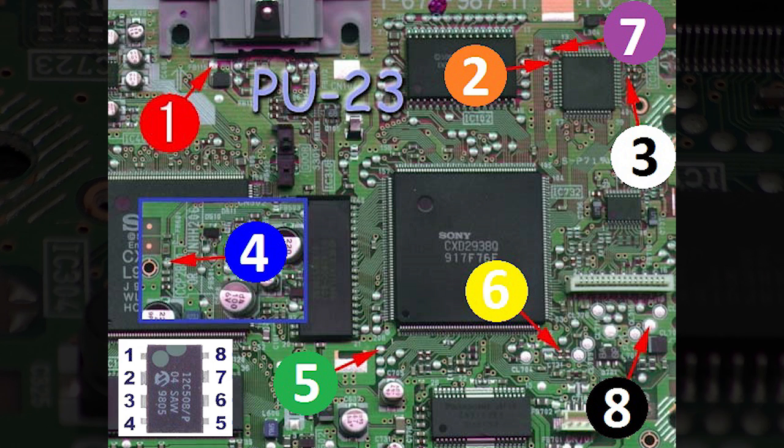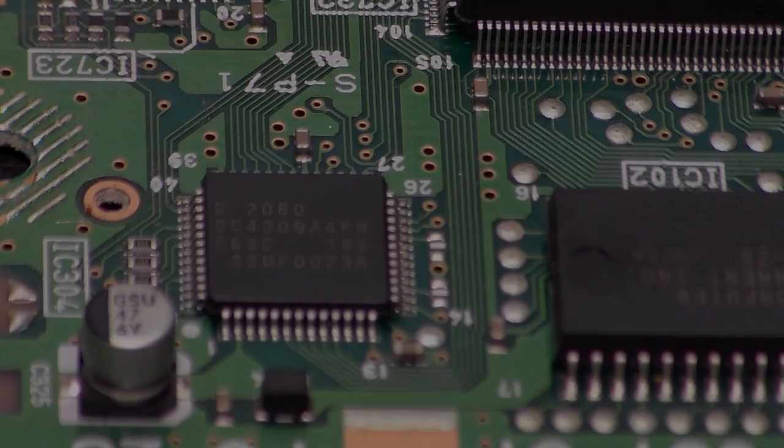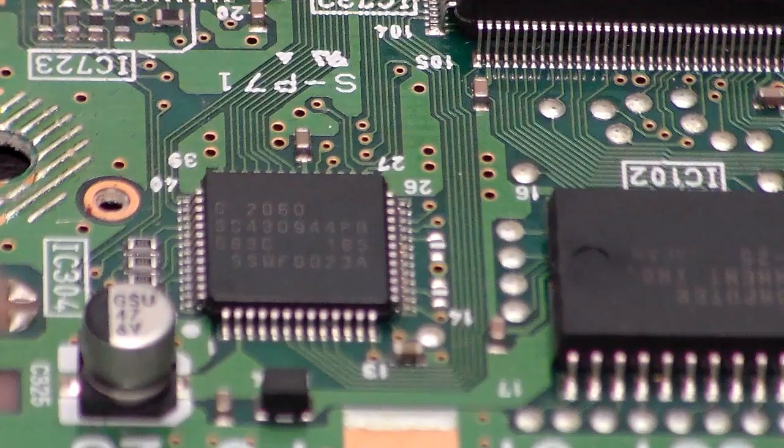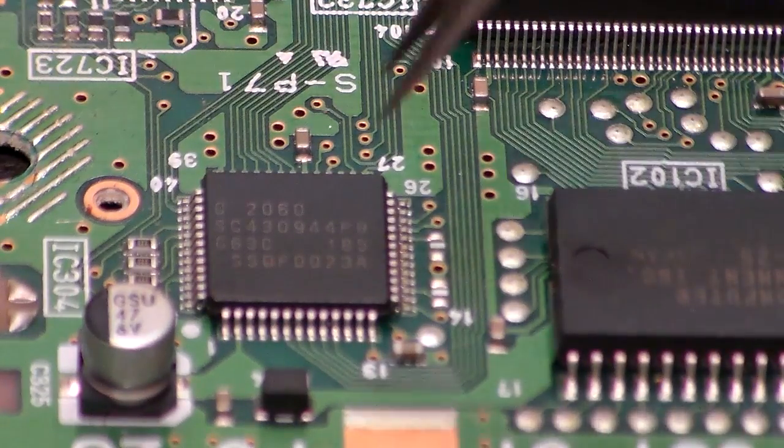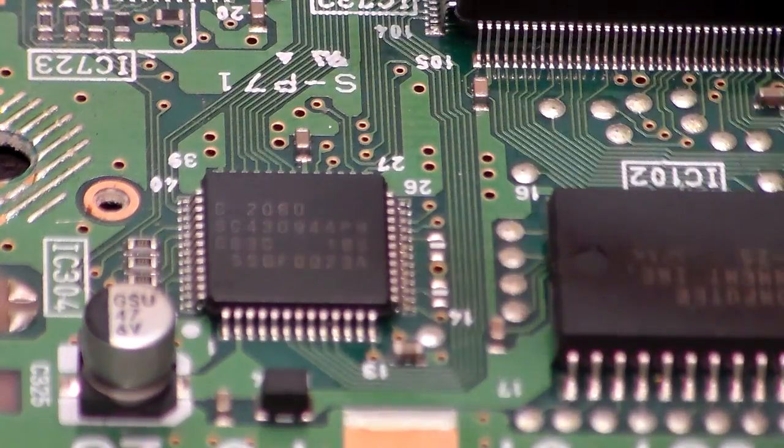Solder points one and four are kind of far away from the general area, so I'm going to solder those two wires to alternate points on the motherboard to shorten the wires and make the install look better. It also just uses less wire. The other points in the diagram will pretty much remain the same. What I tend to do is solder the wire to certain points on the board first, and then once those wires are coming off the board I'll install the chip and run those wires to it — it's easier to reach those points before the chip is attached.